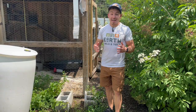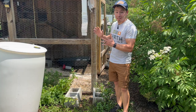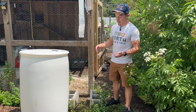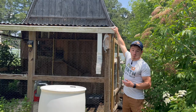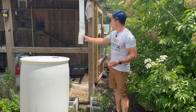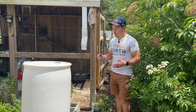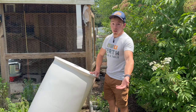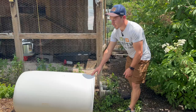The next thing to consider before assembly is where we're going to be placing our rain barrel. I've got a makeshift setup here because I'm using this rain barrel to replace an old one for my chickens. I set up a simple gutter and it collects all the water into my rain barrel. The reason you need to understand your location is because it might add a few additional materials — I have a flexible downspout and a couple of cinder blocks, and we need to consider the orientation of the rain barrel in order to properly make our cuts.